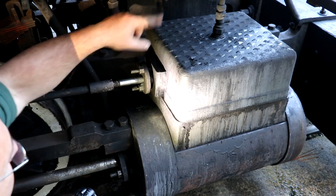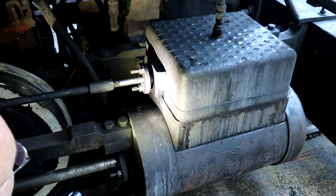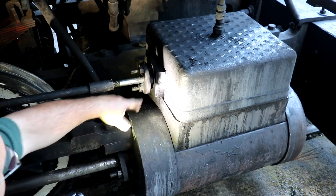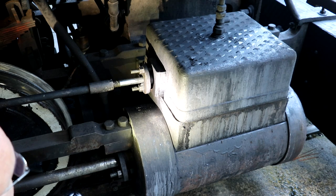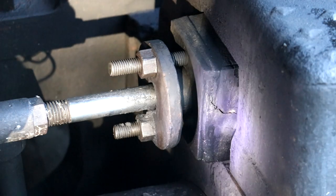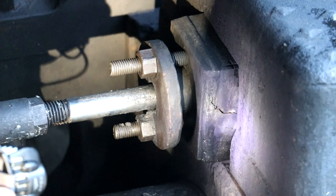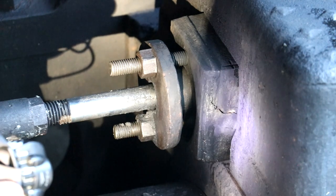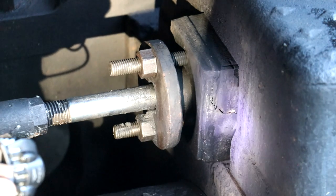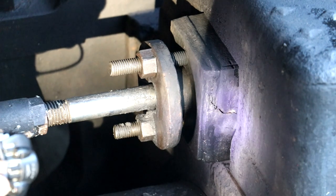What we're going to be doing today is taking this valve cover off. We'll actually be removing the valve body, take the valve out, and get in there and repair that. You can kind of see where it had been welded up one time in the past, and we'll talk a little bit more about that previous repair later on. Just a little bit closer look - you can see that crack in there, and I can tell you that there's a matching one on the back side. We really can't get the camera in there to look at it, but this is exactly where it had failed before and where it had been repaired in the past.